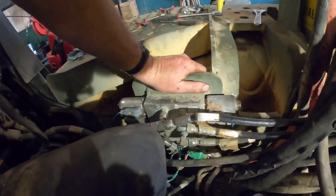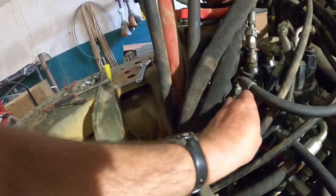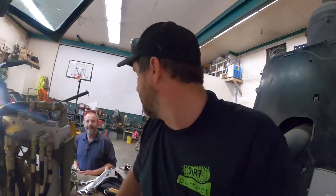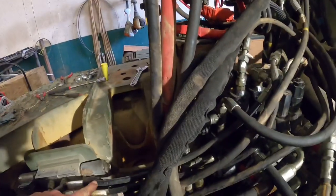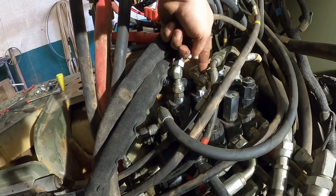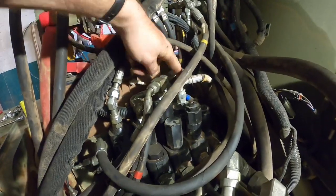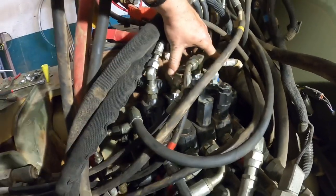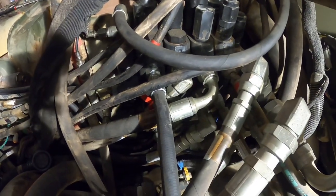Okay, now that we know that this valve will basically do what we need it to do, which is good news, we need to, oh boy, I'm gonna get gray hairs trying to explain this one. So, this valve right here, if you follow it, it's controlling this spool right here. Somehow I need to swap this around to where it controls this spool. Top side is relatively easy. Bottom side is down there in spaghetti hydraulic hose